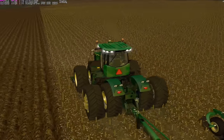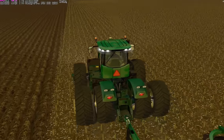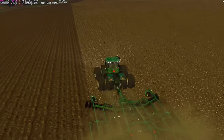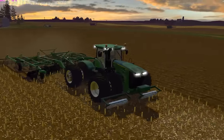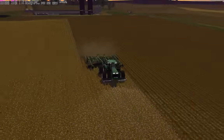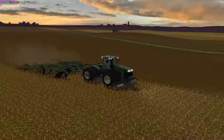So that you can use a little bit smaller tractor on that tool, or you can just go to a wider wingspan, wider working width, increase your speed. But that just chops up your residue, and you can pretty much plant right after that, just because you're not really digging up any kind of massive chunks during the process of ripping.